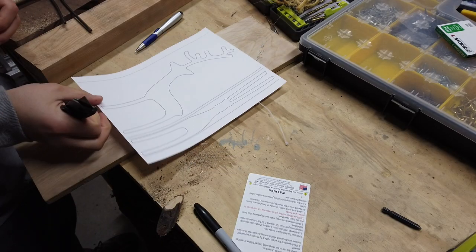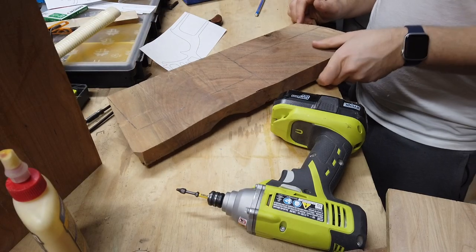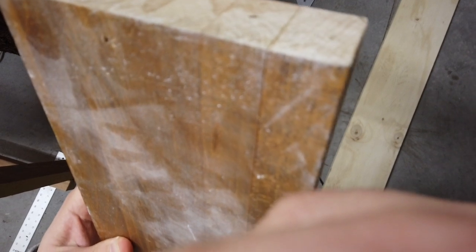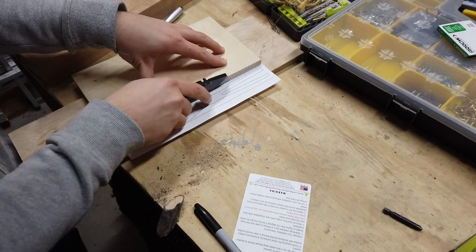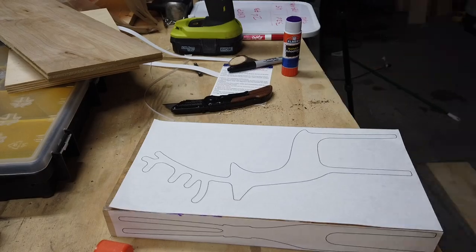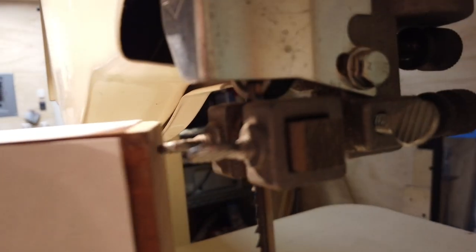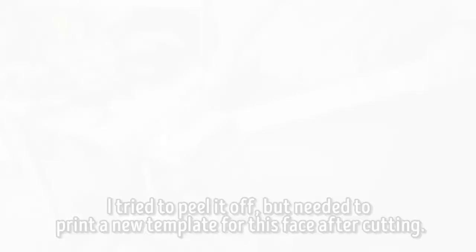So I printed my template in two sizes for the two different pieces of wood that I wanted to use: a piece of hard maple laminated from strips, and a piece of solid walnut. I honestly think the maple might have been a gym floor at one point — I find cool pieces in the scrap pile at the makerspace from time to time. I cut the template out with my utility knife, then used a basic kid's glue stick to adhere them to the wood for cutting. I headed over to the bandsaw when I realized I would have to cut the maple down a bit, since this piece of scrap was wider than the 6 inch resaw height of my bandsaw, so I trimmed the wood on the table saw until it fit.